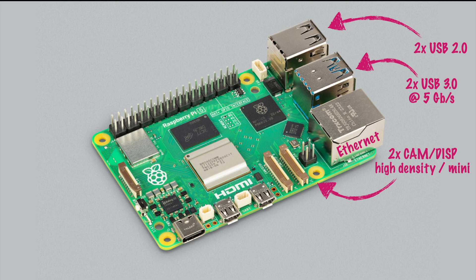For all existing displays or Pi cameras you need an adapter cable, which is already available, so that shouldn't be a problem. But we gain a lot of improvement here. Even though we cannot plug in more than before — we still have two ports — there is a huge improvement because those are now dual-purpose camera and display ports, meaning both can be used as either a camera or display port.